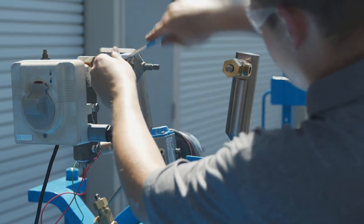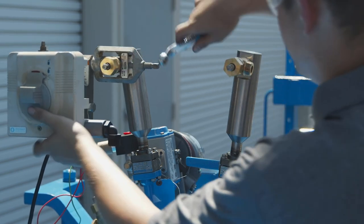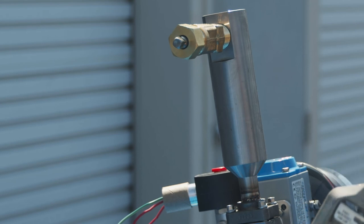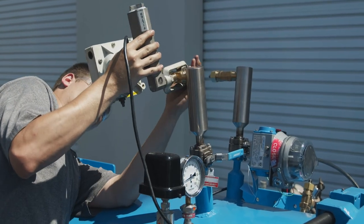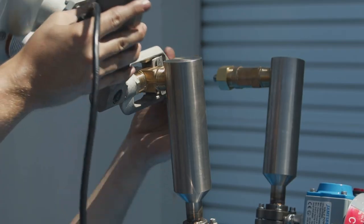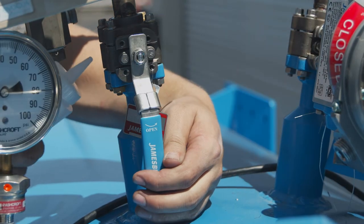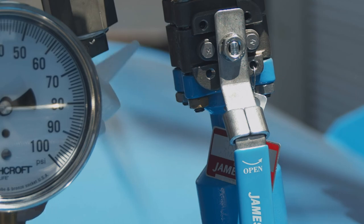In order to do this, first close the exterior chlorine supply valve attached to the vacuum regulator. Remove the vacuum regulator from the exterior chlorine supply valve. Attach the vacuum regulator to the alternate exterior chlorine supply valve. Install a new gasket and make sure that the connection is secure. Open the alternate exterior chlorine supply ball valve and check it with ammonia to ensure there are no leaks.